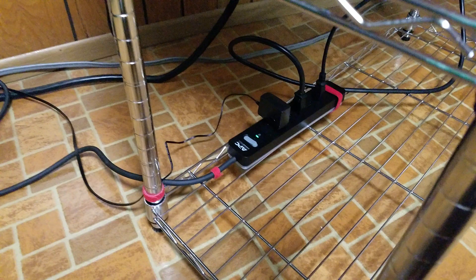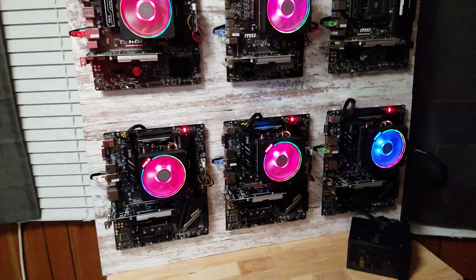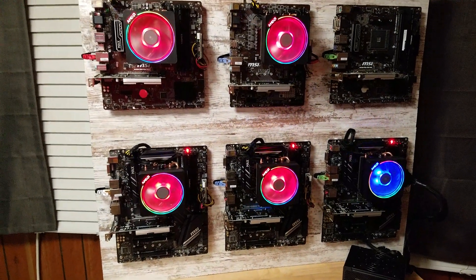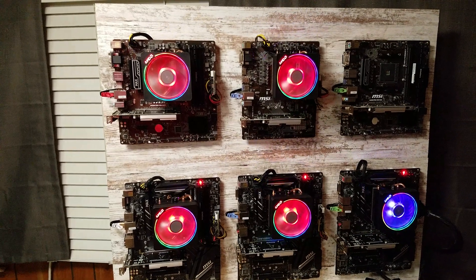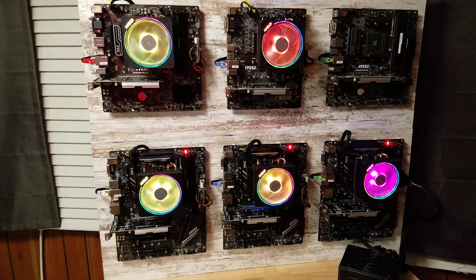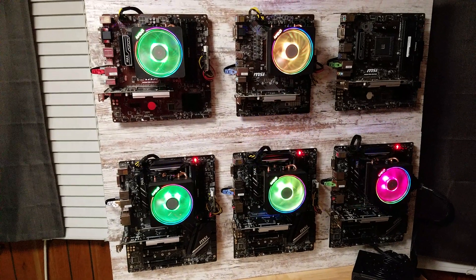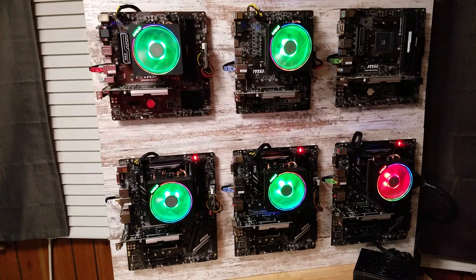Still running. I put it back onto 120 volt. With that, I still have a smart meter so I can see what my wattage is. I was just checking before I made this video. With these five right now at 3600 megahertz, undervolted to one volt, which is pretty stable, I'm only doing about 440 watts.